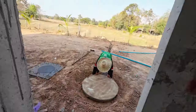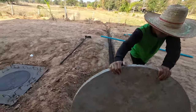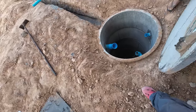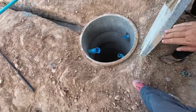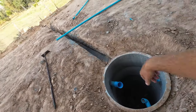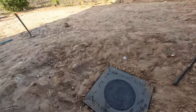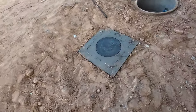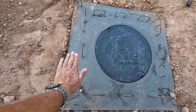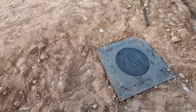So we're going to finish this off now. This gets cut and covered. Septic tank, the grey water tank. That is bloody deep. Stand by. So now we've got a cut in there for the flow out. And on the last bit, you actually perforate the pipe. That's like leaching. Okay, so this one's ready. So basically what we're going to do here is when we build the thing up, that locks in. And then we just make a cap, like a concrete cap, so that you don't see that.